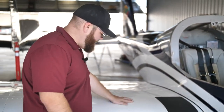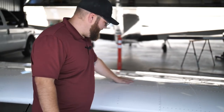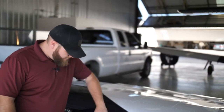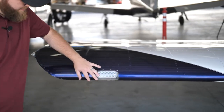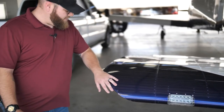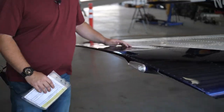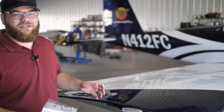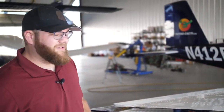Looking over the top of the wing making sure the airfoils are intact and all the rivets are in place. Working our way back, touching the wing to check for damage. We check the landing light LED to make sure it's not broken, then come around to check the nav lights and strobes — they're intact. Because these wings are removable, they have handholds, and the POH actually asks us to give them a yank to make sure they don't come off. We give it a pull — it's solid, nothing to worry about.